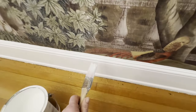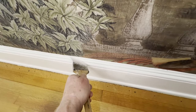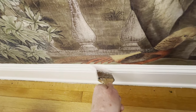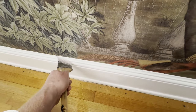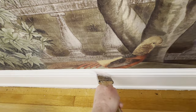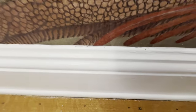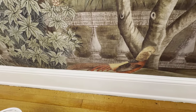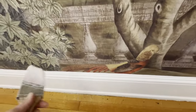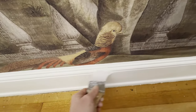I'm not covering all of the surface I want to cover — and why is that? Because I've exhausted the left-to-right stroke. It's not getting the paint into that area, so now I have to start on the right and go left. I'm reversing the brush in this procedure and going up onto the surface like a ramp.